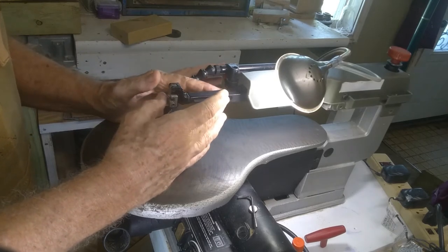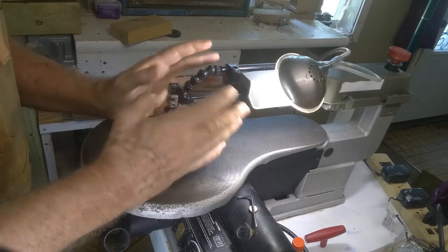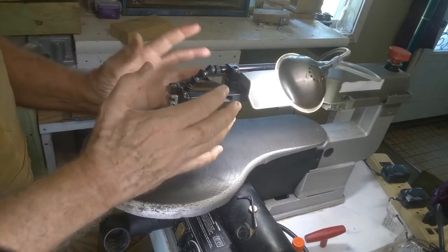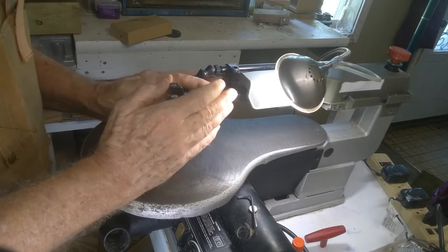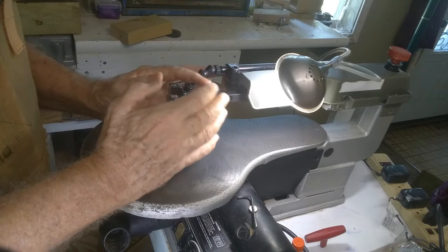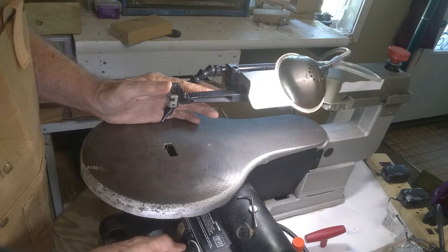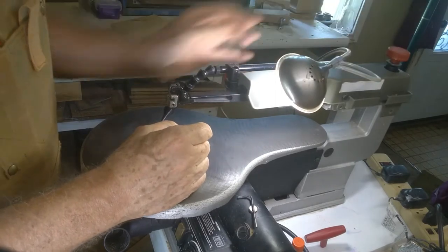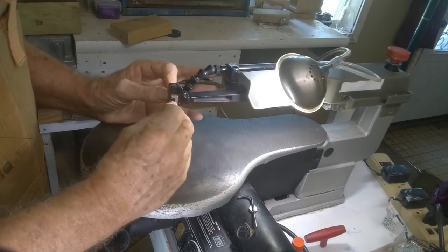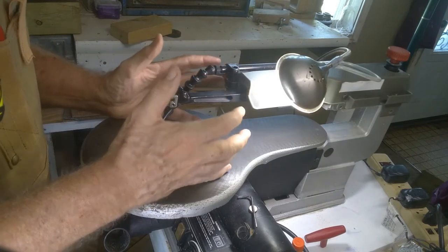Also, the speed control and on-off switch can be up front, and that varies from saw to saw. But having everything right there in front of you is very desirable. That's what the double parallel linked saw normally offers. On my saw, the on-off switch and speed control are down here, and the tension control is back there — that's the most irritating. If you get a saw, you want the tool-less blade and controls up front.